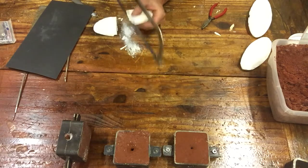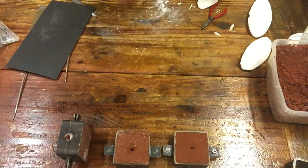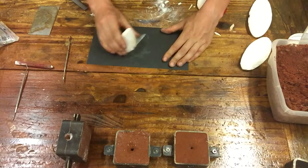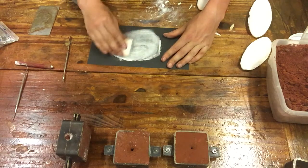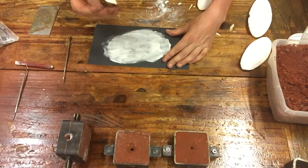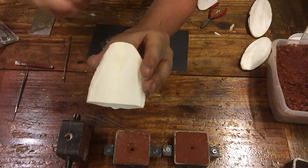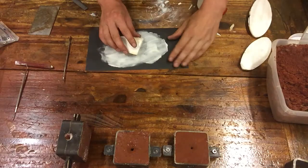The first thing we're going to do is cut through the cuttlefish backbone. Clean up the debris — it's going to smell like dried powdered squid bone and hair while you're working, so your cats are going to love you but maybe your spouse or partner may not. The first thing I want to do is get this nice and flat. You can see I've got a piece of sandpaper and I'm just working in a circle or a figure eight — it doesn't matter. What you're trying to do is get your cuttlefish clean enough so that there isn't this signature groove, because that's going to end up being a leak in the casting where the metal flows out. We want to get this to one nice uniform plane.